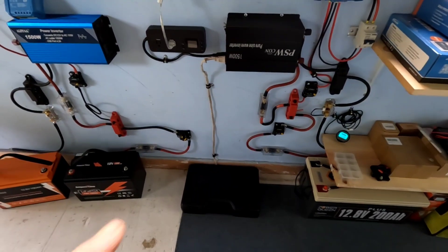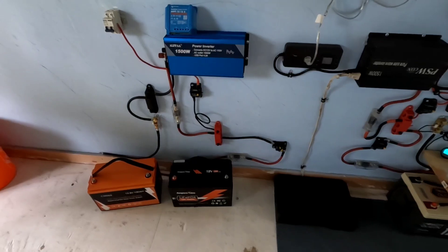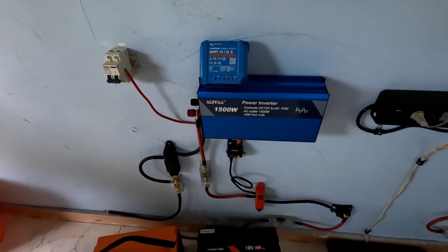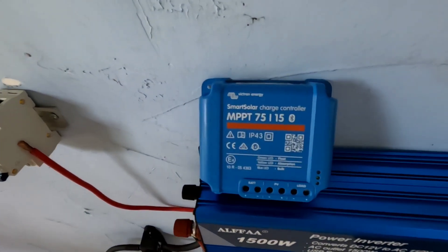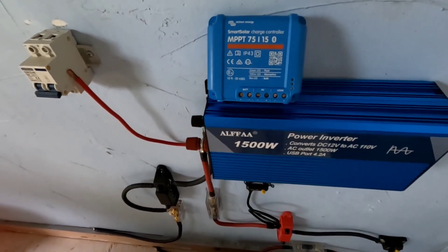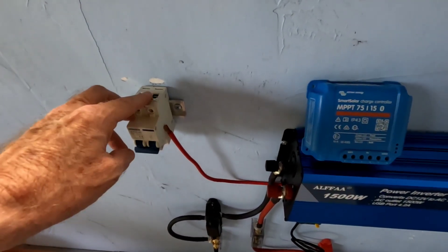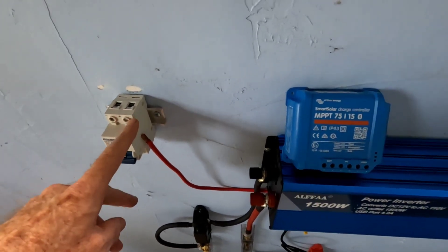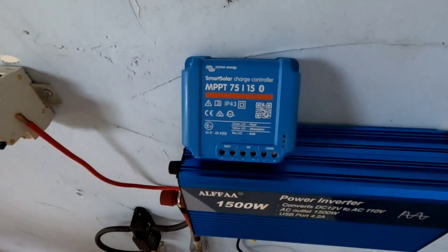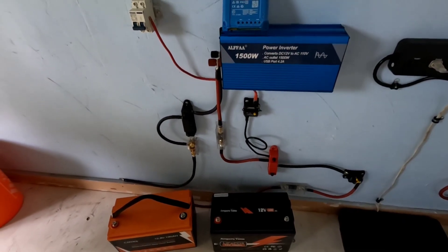This standalone system gave way for the power wall to increase in size, and this is just about done — just got a couple more holes to drill through the wall to tie in the Victron MPPT 75/15, which is what's going to run this little separate standalone system. All I have to do now is run my solar panel cables into this isolator switch. I'm probably going to put that Victron about right there — I'm not totally sure on that yet — but I'm going to get it figured out here in a few minutes. This is going to be a standalone charging station only.